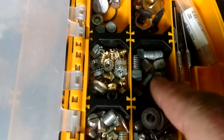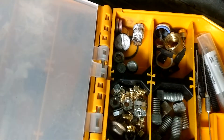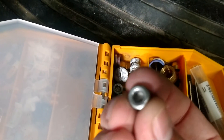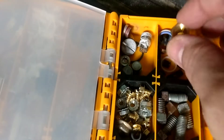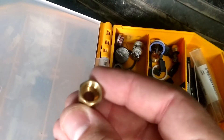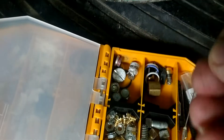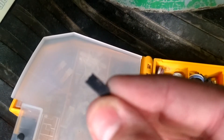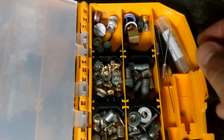Got some gas valve parts — we all drop them in a crawl space and they go flying and then you're screwed. So I keep gas valve plugs, the adjustment set screw plugs, a water ferrule to fix a water line on a humidifier, and the little jumper for the defrost boards — for 30, 60, 90 — because that thing flies off in the snow and you can't find it.